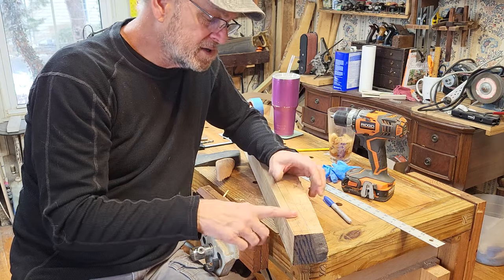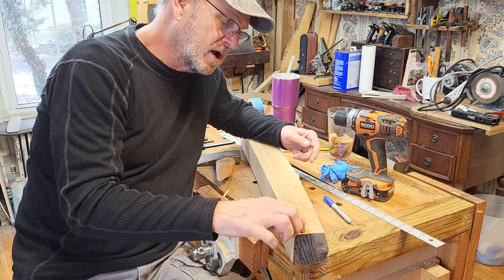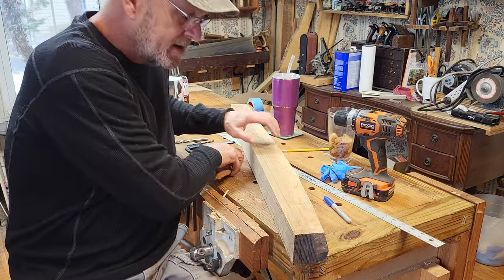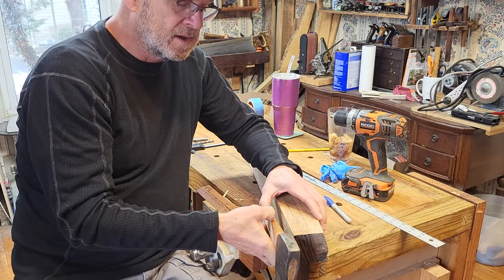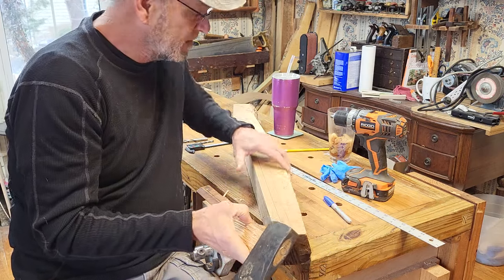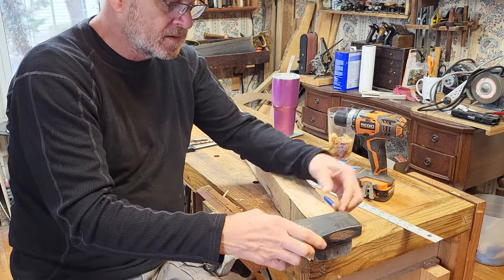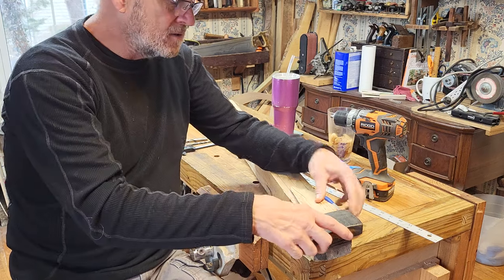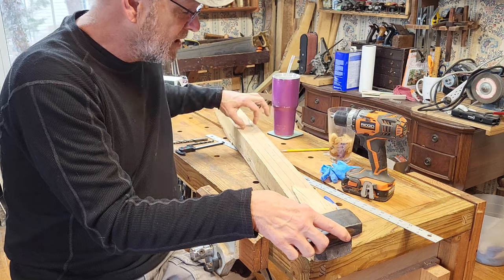If you're going to do it for customers, which this one is not, I realize that, but if you're going to do it for a customer, you need this head to sit on here square, sit flat so that it's fairly perpendicular to the handle, okay? Fairly perpendicular to the handle, and you need it to be straight in this side and in this side